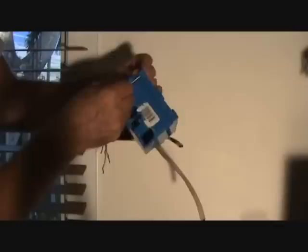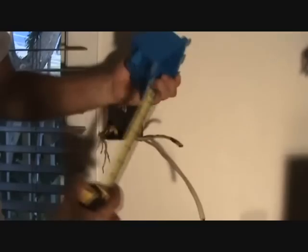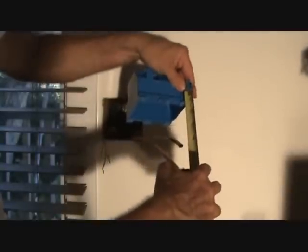There's a definite little groove in this box too — make sure it's in that groove so it wants to slide up and doesn't want to slide out of that groove. I got 7/8 of an inch on that one. Push the screw in all the way there — I got 7/8 there so I've got plenty. Now we're ready to put this box on.